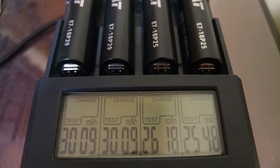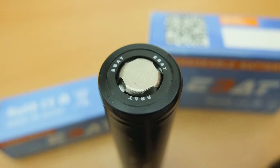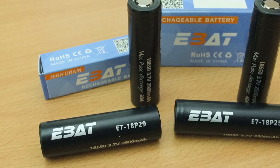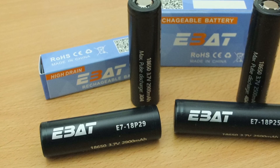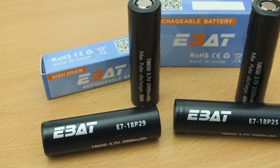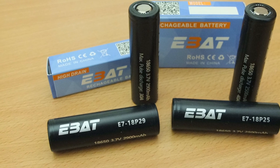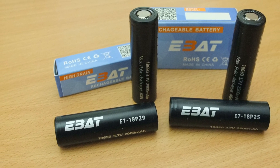There are a couple of safety points to note. These don't have a protection circuit, which isn't a problem in most cases, but don't over-discharge them as that doesn't do a lot of good for keeping performance at its highest level. Also watch for short circuits — because of the lack of protection circuit it shouldn't be a problem in most cases, but something to bear in mind. If you've got a lot of these batteries, try to keep them in a case where possible.